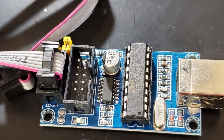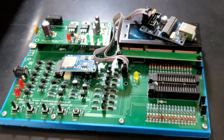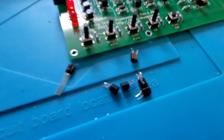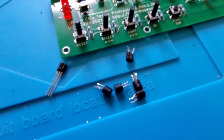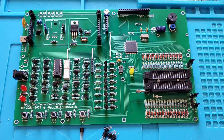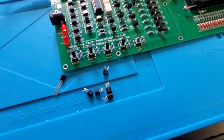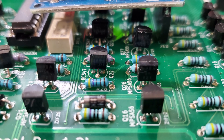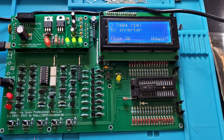Once everything was put together I programmed the controller — you don't want to see that. I fumbled around for hours with a process I wasn't familiar with. The USB Tiny programmer I'd bought wasn't ideal, but with help from online posts I got it working. The chip kept failing, even on known-good ICs, so I dug in. It turned out the substitute switching transistors from DigiKey had a completely different pin assignment. The fix was to replace them with 2N2222As I had on hand — they're the exact opposite pinout, so I just soldered them in backwards. Bazinga, we're testing chips.